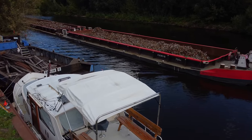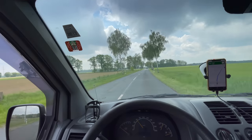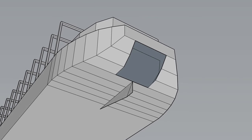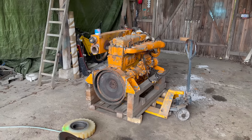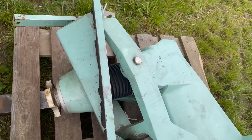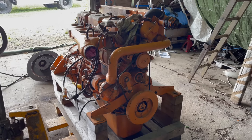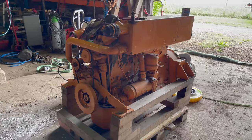I'll start with something where I spent a lot of time and effort but never got the opportunity to put in any videos. You may remember that in a previous video I talked about installing an inboard motor with a stern drive into the big barge boat. Well, earlier this year I actually got a huge powerful diesel engine together with a stern drive capable of handling this power. The motor is a German-made Henschel 523, a straight six-cylinder diesel engine with a ridiculous 12 liters of displacement, a very adequate 230 horsepower,